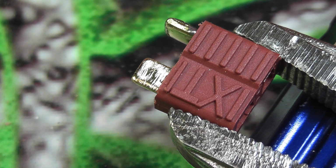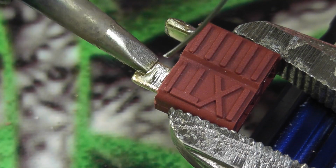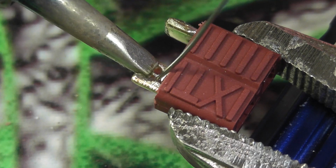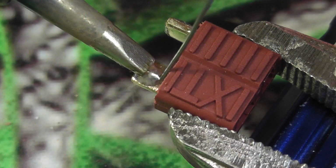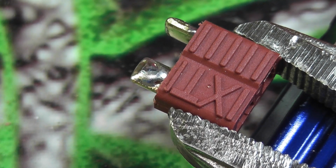And it happens pretty quick because the solder ends up flowing almost instantly, it actually only takes 3 or 4 seconds to tin the entire tab, which is ideal because then you don't get excess buildup. So here I'm applying heat. I'm going to put the solder where the thing is. It's pulling up now. Now I'm going to pull back, and then pull off, just like that, fast. And as you can tell, it's got a nice shiny coat of tin on there now.